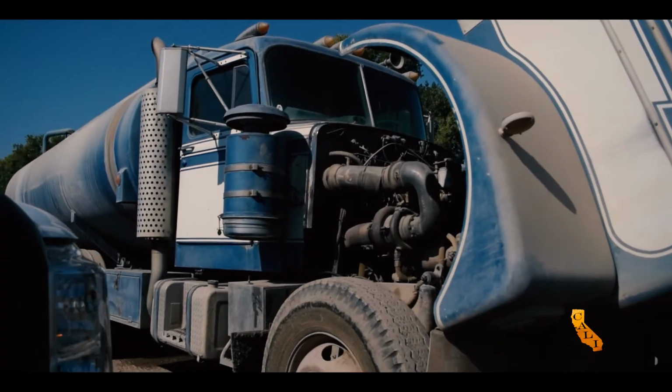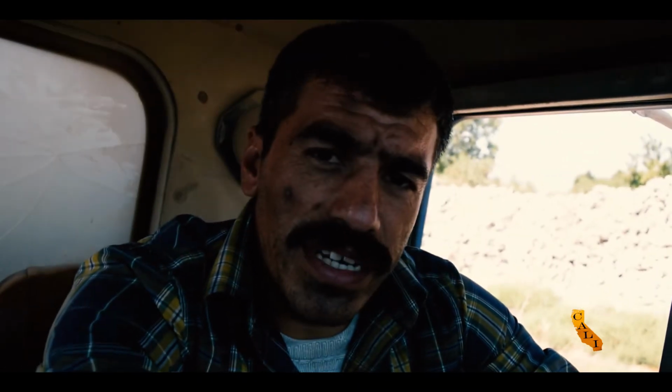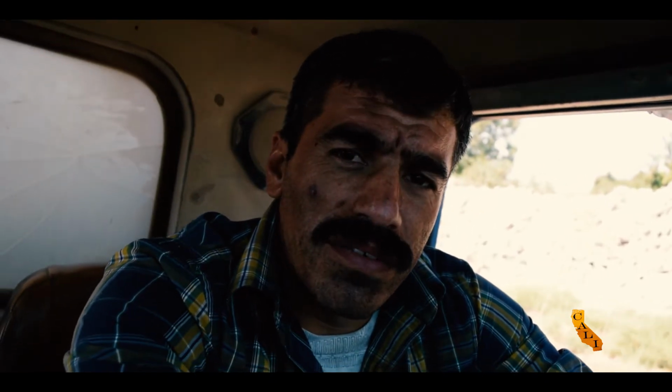The bushings on it are bad. It's an old truck. We're gonna go ahead and start with the linkage. Secure it, make sure it's nice and secure. I checked underneath, our motor mounts are pretty bad. They're going through the metal already. We're gonna take those apart and find out if we can either fix them or fabricate some new ones.